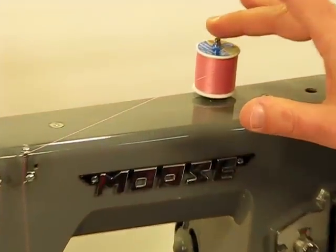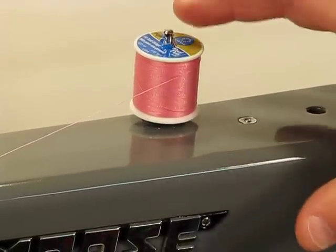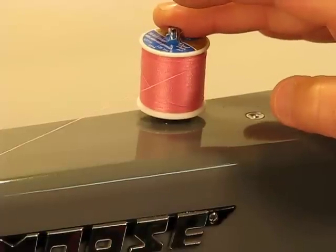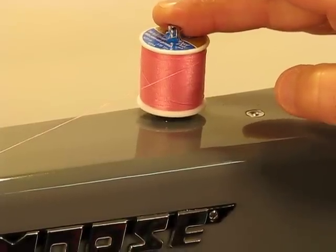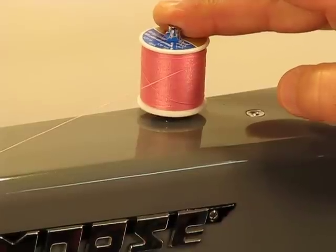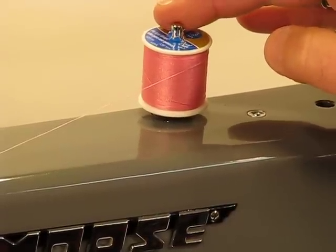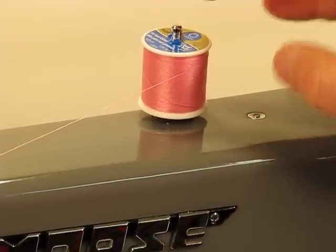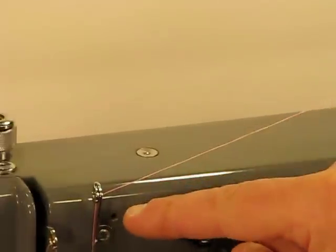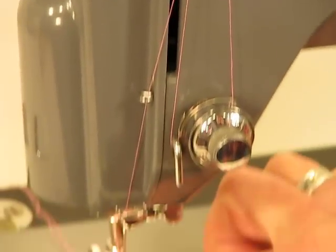Let's go back to the machine. Follow me to the top — you can see we have a spool pin up here where the thread is mounted. With the technology of needles today, what traditionally was relegated to straight-stitch sewing can now be expanded. Needles with oversized or over-under type holes allow two threads to be fed simultaneously, so there is an opportunity to do dual-needle sewing with this machine as well — you'd probably want an auxiliary thread tree behind the machine to feed that second thread. This machine is also extremely easy to thread, with a single thread guide down through the tension control, up to the arm, and all the way down to the presser foot.